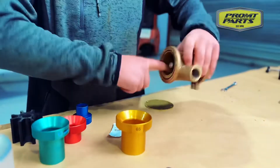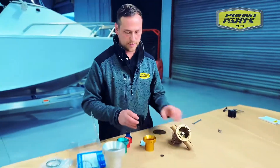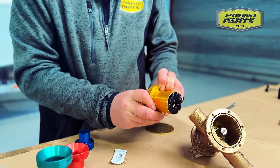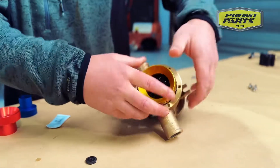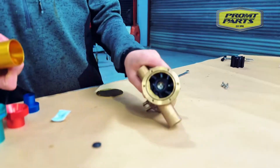Wind a little bit of lubricant in through the side there, a little bit in through the housing, then grab the impeller and slide it into the tool. Bring it out until it's just protruding. Push into the housing, drop down, apply some pressure and pull out the sleeve. And just like that your impeller's in.